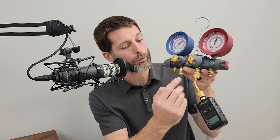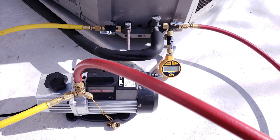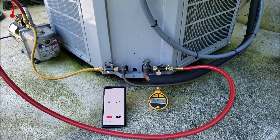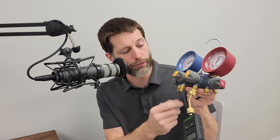This would be considered the service port. If you were charging refrigerant, you'd add it here. During your vacuum, you'd add a 3/8 hose from here to your vacuum pump, read your vacuum level here, and connect here and here to the system. That's a lot of hoses and a lot of possibilities for leaks. The recommended method is just connecting the vacuum pump directly to the system via two hoses. For a two-port system, it only requires two hoses to do a vacuum; on a mini-split, it's only one hose. So really, the only purpose a four-port manifold exists is to draw a vacuum through the manifold.